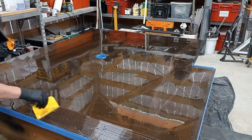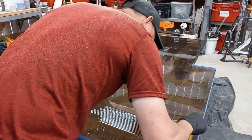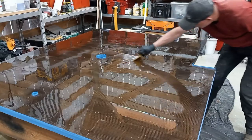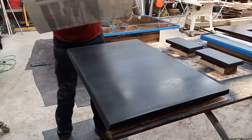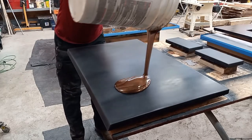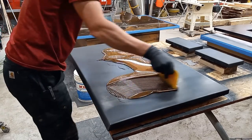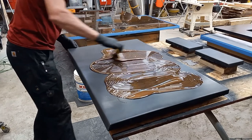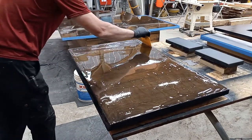This time I'm using a plastic spreader to spread out the epoxy. I cut V-grooves a quarter inch deep in the spreader so the epoxy would spread out nice and even over the entire panel. This also added a nice effect to the mica powder. I taped off some of the edges on the panel so the epoxy wouldn't immediately run off. The downside is you have to pull the tape at the exact right time — when the epoxy is thicker — so that when it runs off the side you have a thicker edge to your panel.